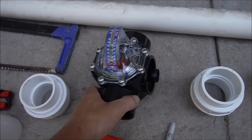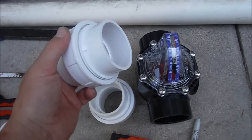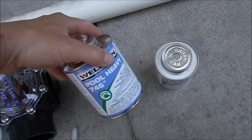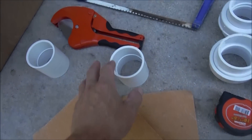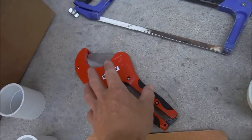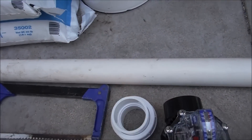I'm going to go over plumbing in the FlowViz complete unit. I'm going to use two-inch unions, which is the easiest way to plumb this in. I'll need some primer, PVC cement, a Sharpie, a ruler, sandpaper to clean the pipes and sand off any paint. You might get these at Lowe's, along with a hacksaw. You'll also need some two-inch PVC pipe.